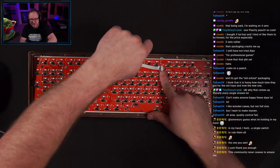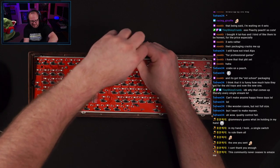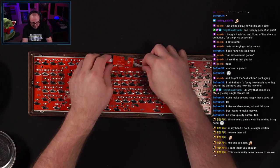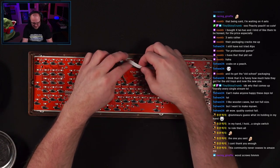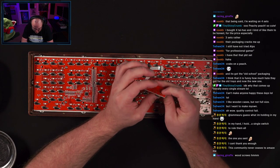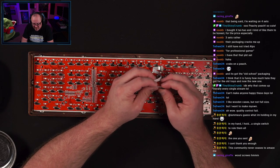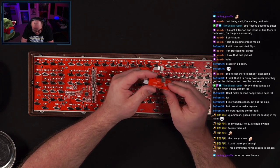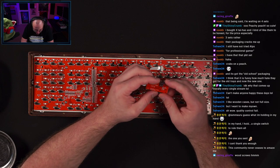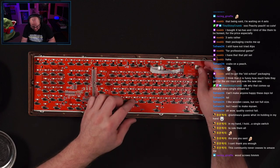So there's a daughter board with a little connector deal. We're gonna pull that guy out. I'm guessing that it's the daughter board that's a little loose, and there's not a lot we're gonna be able to do about that. Yeah, the connector itself is definitely not loose feeling, which is good. I don't see any looseness, it's not wiggling. Solder joint is all good, apparently. Looks good. Yeah, I'm gonna call that good, right? So we're gonna leave this on top of here, right? We're just gonna look at kind of what's going on.